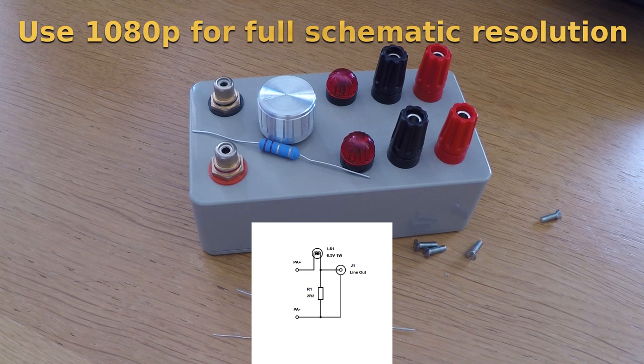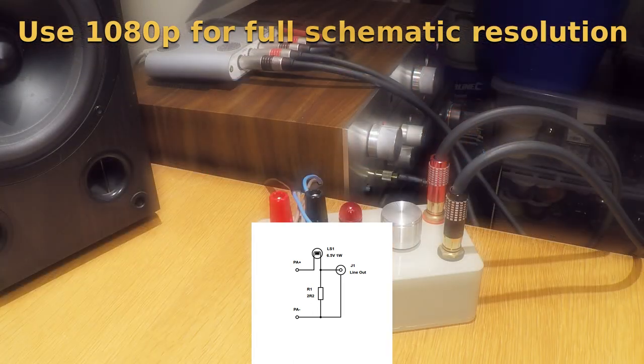So far, I've only shown unbalanced outputs, which could lead to ground loop issues between the two stages connected on either end of the compressor. Although it looks to be fundamentally unbalanced in operation, it's perfectly possible to include an output which takes advantage of the common mode noise cancellation benefits that balanced signalling can provide.